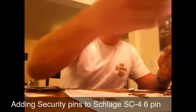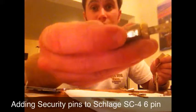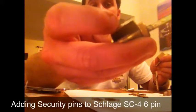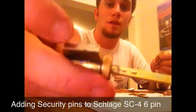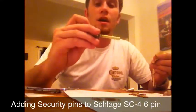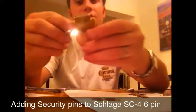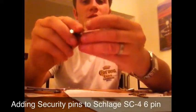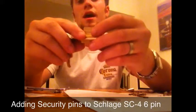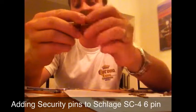Some of them may have a flat piece of metal that is crimped in there. You can carefully pry this out where the edges are bent over so you can slide it out and save it. It makes it a little more difficult getting it to stay back in there and keep spring tension. This lock here has been re-keyed in the past by a locksmith and set screws were added in the top here, which makes it a little bit easier. You can do one cylinder at a time.